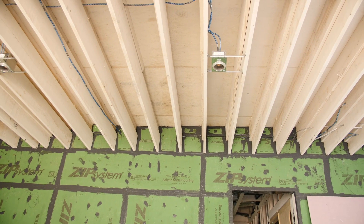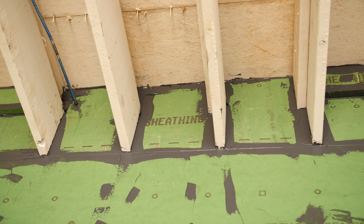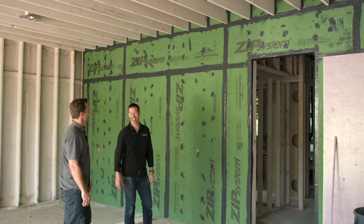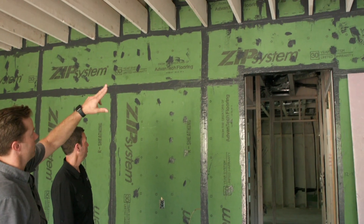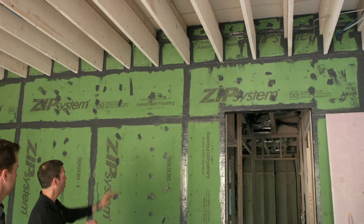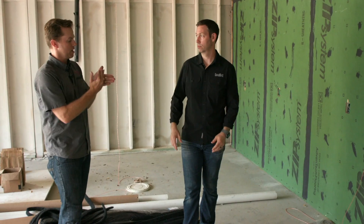What's above us here? This is a second-floor patio deck, so we had to slope the ceiling. Those sistered 2x12s — one's for the flat ceiling of the garage, the other's a sloped floor for the patio. It's a flat roof with a deck above. I would have liked to run a ledger, run the Zip first, then a ledger and hang joists, but the engineer didn't like it. So we had to cut and caulk all those little pieces to get that air seal as good as we could. If I had to do it again, I would run a bead of caulk along one of those before sandwiching it to the other one.